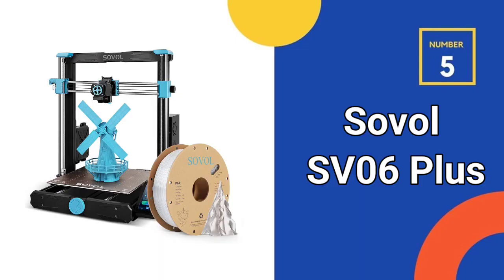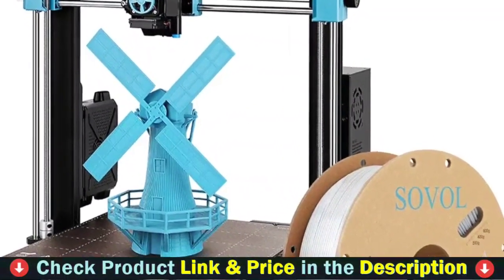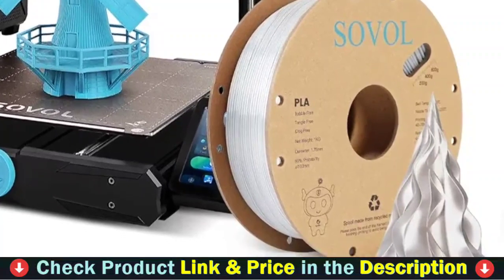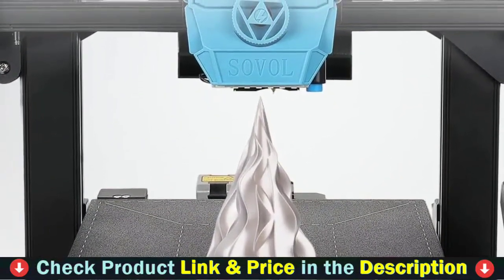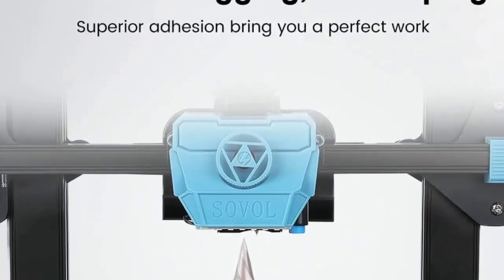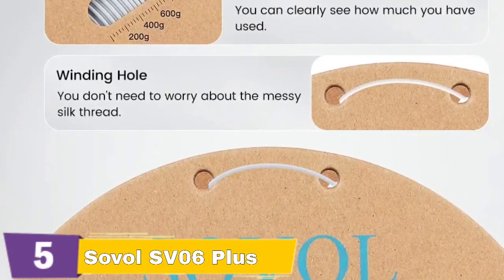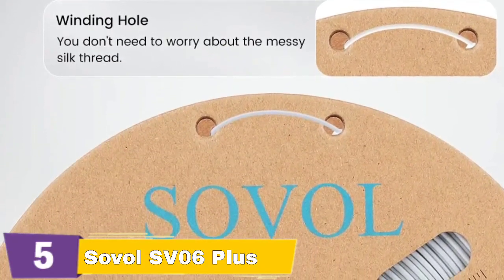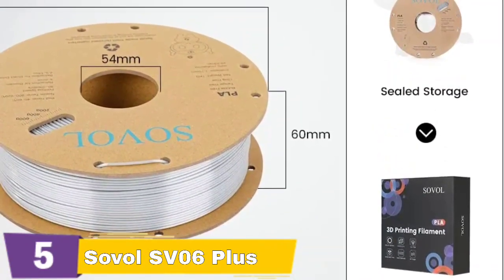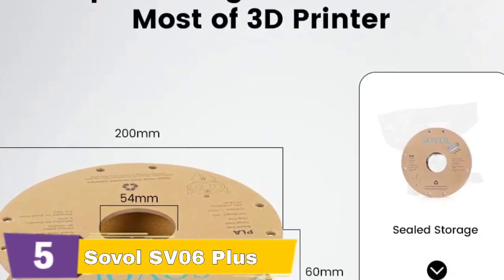Number 5 and our last choice is the Sovol SV06 Plus 3D printer. Different from most 3D printers that run on wheels, the SV06 Plus has a classic i3 structure which avoids wear and tear of wheels and multiple replacements. This 300 x 300 x 340 mm printing size makes the SV06 Plus unique among i3 structure 3D printers. Modular design allows you to assemble SV06 Plus within 5 steps. The all-metal hotend with larger melt zone enables faster printing — high flow up to 20 cubic millimeters per second to achieve 150 mm per second printing speed, greatly reducing the probability of clogging. The all-metal hotend setup makes it possible to print up to 300°C, with no need to deal with PTFE replacement or even flash the firmware, so you can print with different materials better and more easily. An enclosure is still needed if you want to print over 260°C.